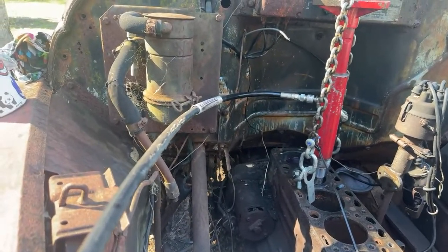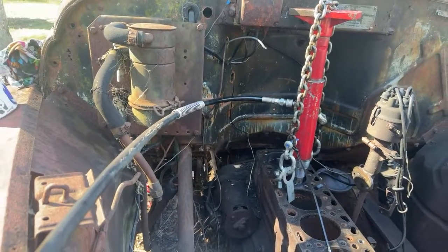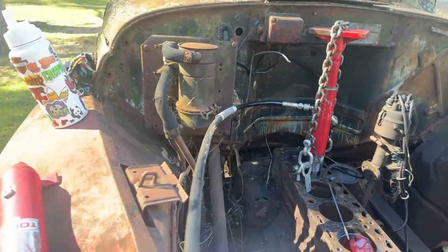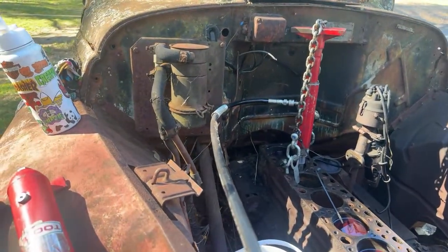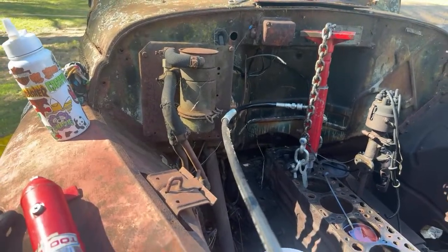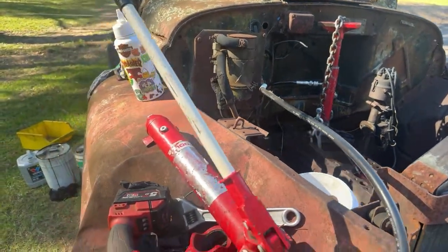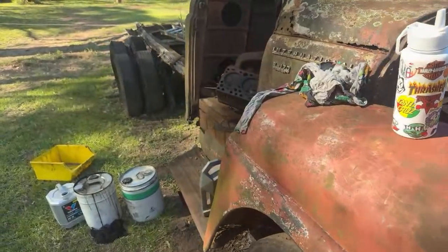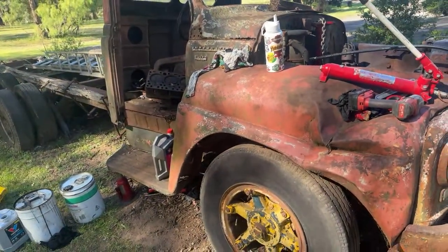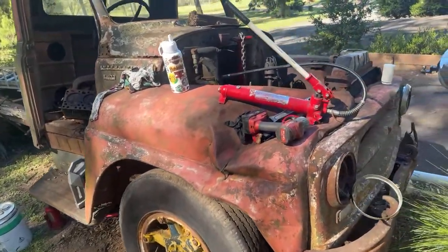I think I've had it on each cylinder, each piston like that with that chain on it. It hasn't done anything. I think they're all seized. So what we're trying to do is unseize the whole lot by using the crank on one. So I think I'm going to take the sump off. I've just drained it. Take the sump off, and I think we're going to have to free each one up individually.